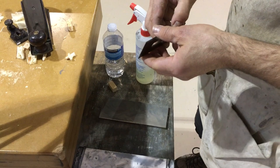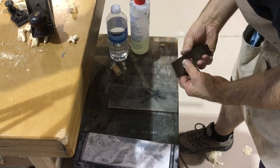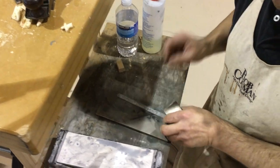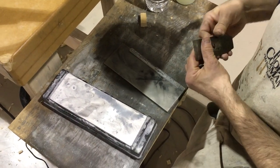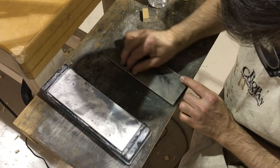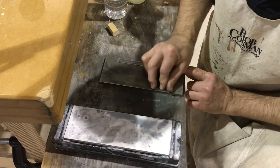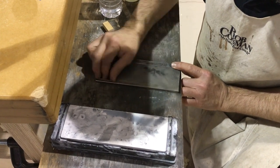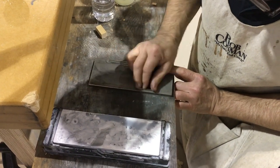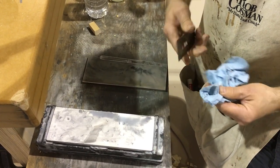I don't have a grinder here, but that looks to be about a 30-degree bevel on there. What I need to do is put a back bevel on this — I'll treat it the same way I would any other plane. Using a steel rule and a 1,000-grit diamond plate. Another problem with doing these is that they're so thin they'll actually flex under the weight of your finger pressure. What I want to do is put a little back bevel on there so I don't have to go through and flatten and polish the entire back of the blade. I have no idea what shape this is in, so let's take a quick look and see if we're getting anywhere near close.